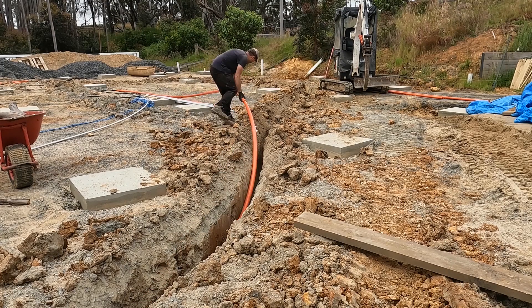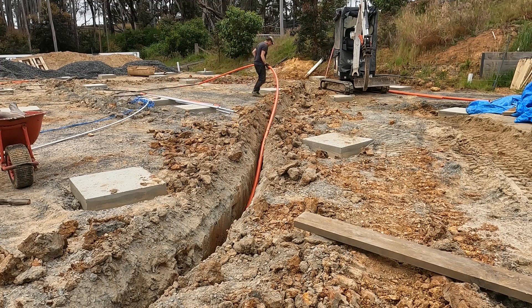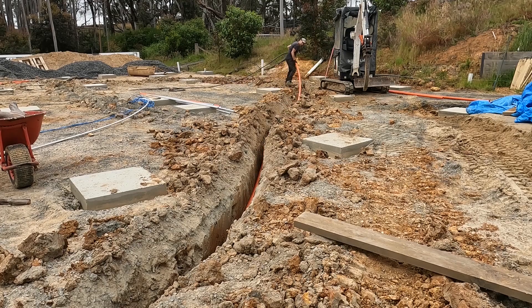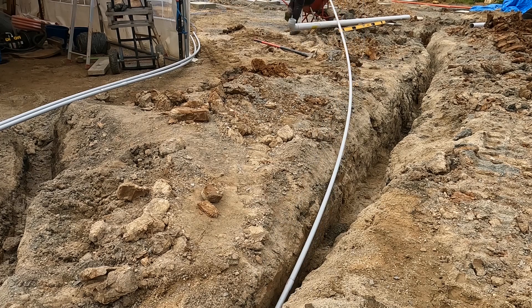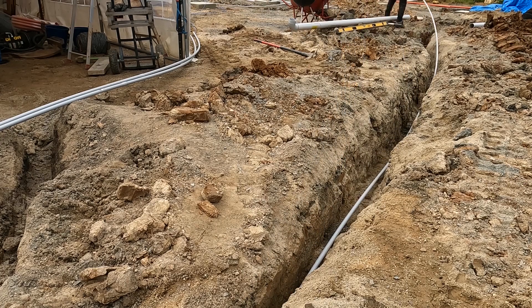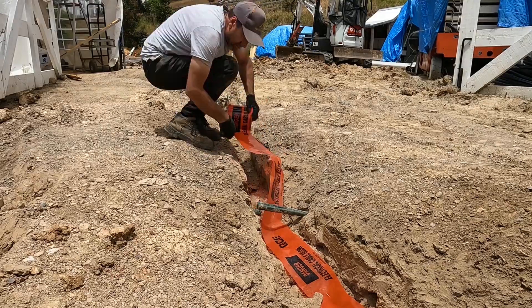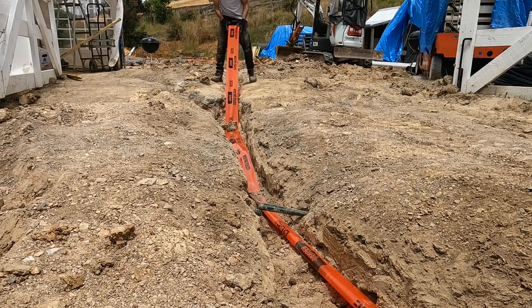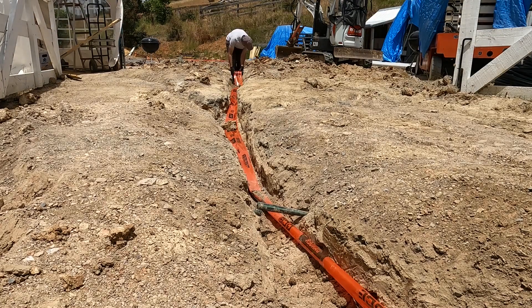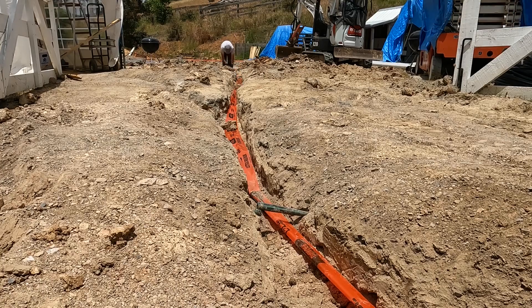On the workshop end, doing the last bit of the main supply - dropping that in at about 700 millimeters deep. I backfill about a foot, then these are the data cables in conduit. I backfill over that conduit and then put the marker tape in. The marker tape is probably less than a foot underground, and the purpose is clear - if you ever dig there in the future you'll know there's a power supply underground.